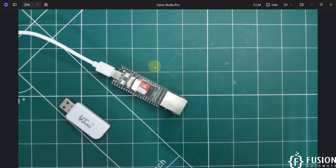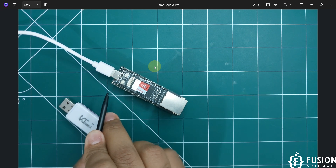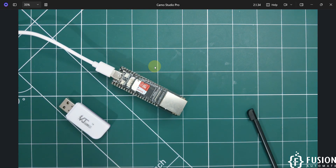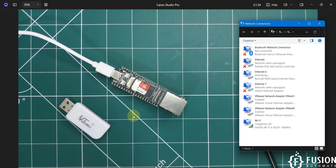The user LED is flashing, which means the operating system is booting. Once it boots successfully you will hear a beep sound. You can also verify the boot by going to View Network Connections — once the LuckFox Lyra board boots successfully, you will see a USB Ethernet adapter appear.